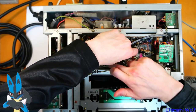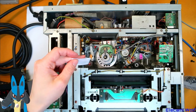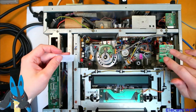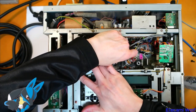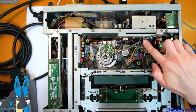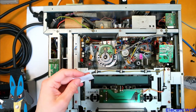I remember the other one I looked inside a few years back — I probably need to get rid of the tape. It had capacitors leaking on a bunch of the boards, so it was pretty much had it. I can already see from here on that board there's corrosion on a bunch of parts around the capacitors, so yeah, it's finished.